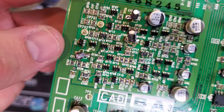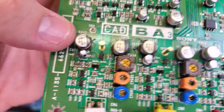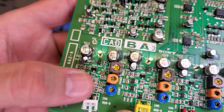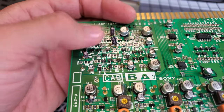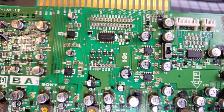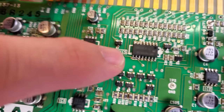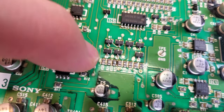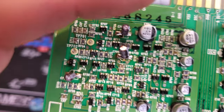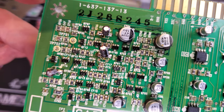There's fluid here, but there's been some repairs done to this board before. If we look over here at C602, that was originally a surface mount cap and somebody came in and changed it with a nice cap — actually did a good job on that repair. So this was professionally repaired before at one point. You can tell these caps up in this zone failed, and I'm guessing most of the other caps were still in good shape at the time that person did the repair. The solder looks pretty fresh on a lot of these points, and it looks like the solder was reflowed on this chip and some of these components.